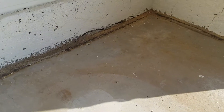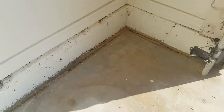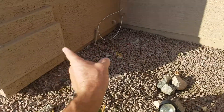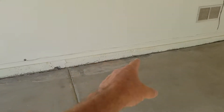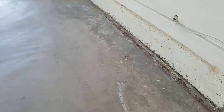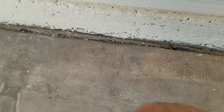There's oxidization of the rebar that is just below the dirt grade on the other side. The repair would be starting from the driveway corner, around to the corner, to the inside corner. You can see the oxidized rebar and horizontal crack here. And there seems to be efflorescent salt deposit on this side. It was easy to see in the other video that the water is holding.